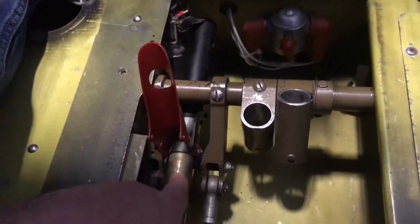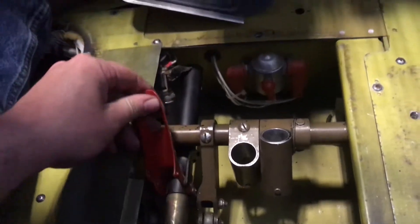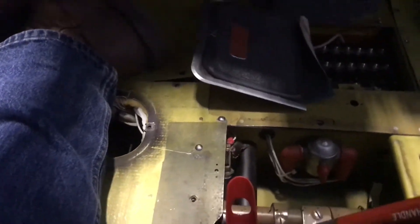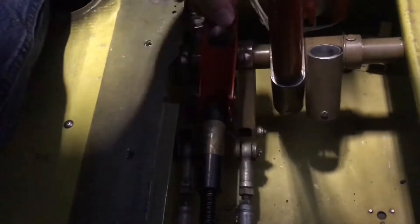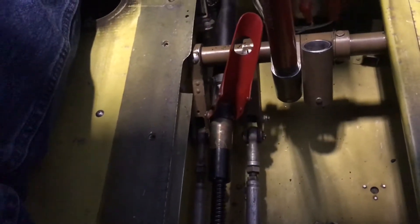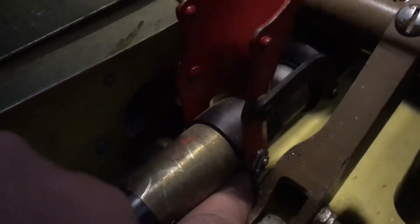What a lot of people have a hard time with is reconnecting this. So this is pretty easy — we've got our master switch in, we've got our gear handle down. What we're going to do is take our extension handle, put it in here, open that bail up as much as you can. Just a little bit — that's overcoming the down switches, and you're going to bring it back until the little notch on the end of that lines up with this little rod here.